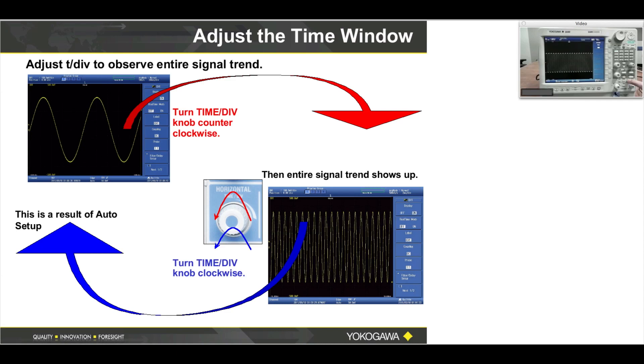Press where my fingertip is — see measure. Press soft menu button number one where it says measure mode; it says off, but press it and set it for on. Then press soft menu button number two — measure setup. Turn the large knob until you have period highlighted, which is here on the screen.